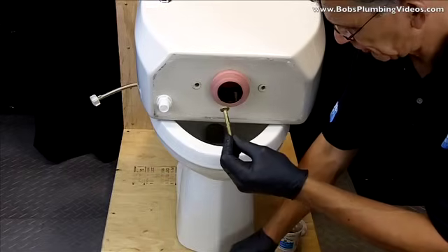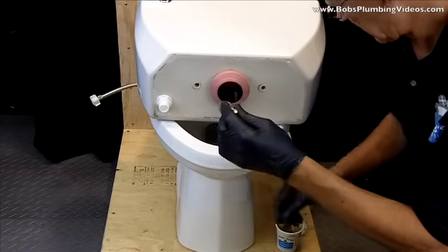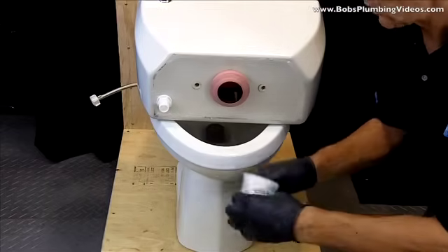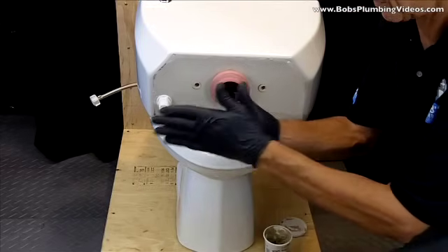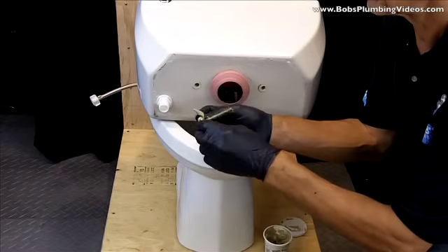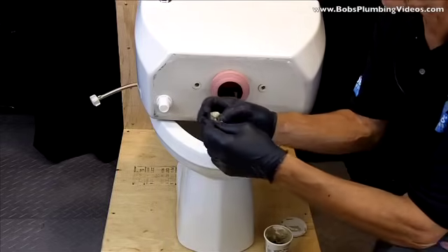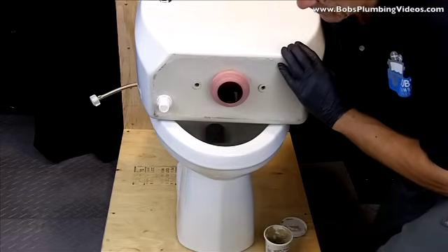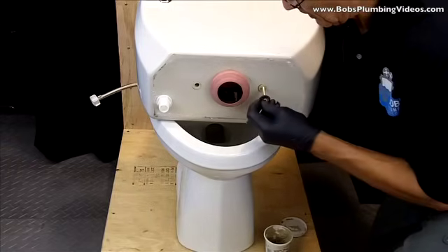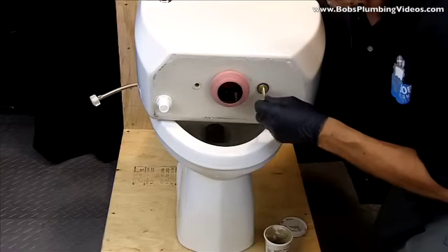The procedure is to put your washer inside the tank. For insurance purposes — and a lot of guys think I'm crazy for this — I use a little plumber's putty. I make a small ribbon with my hands and back up that rubber washer with a little plumber's putty. A lot of guys feel it's not necessary, but I've never had a leak through a set of tank bolts. I've seen brand new tank bolts leak, and in an effort to reduce my callbacks, putty does the job. Set it through the tank and you can see the putty squeeze out.